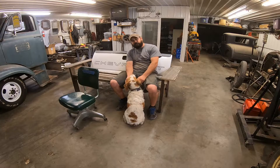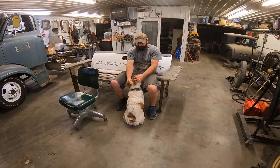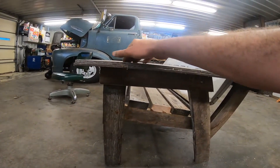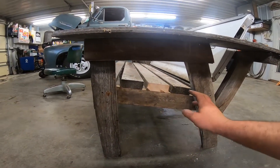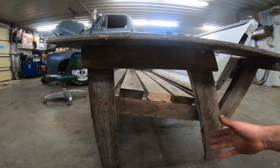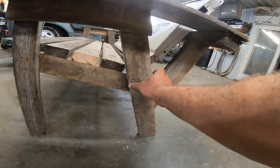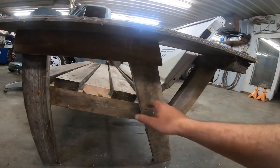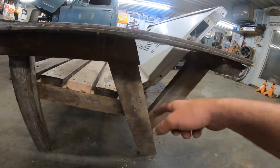All right, let me give you a quick walk-around to show what I've got going on here. Here's a side view of how I started. I cut this board at 27 inches because that's where I want my elbow — with the thickness of the one-by it'll be a little taller than 27 inches, but I cut it at 27. Cut this seat board at 18 inches. I laid it on the floor knowing I wanted 19 inches high at the front and 16 inches at the back, laid it out, screwed it to this board, stood it upright, held it up with my floor jack. Once I got it level I put this back board up at the angle I wanted for stability, laid a level across front to back, knew where to cut it at the top and at the bottom, and screwed those together.